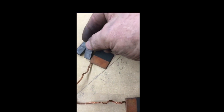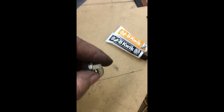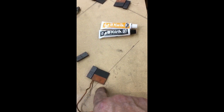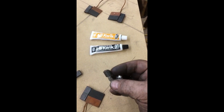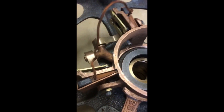You'll notice I left a little copper lead on — that little wire that goes into the carbon brush is your conductivity. I left it on and milled it so when I glue it the conductivity is preserved. I'm going to glue these on the surface, and I have to increase the depth — I'll probably do that with little pieces of wood that'll allow the spring to push up and use up the carbon brush. You're probably asking why you're listening to this, but if you've got an old motor with a brush you can't buy anymore, here's how you fix it.